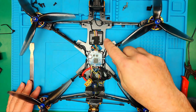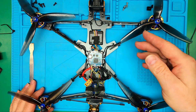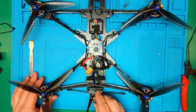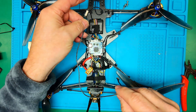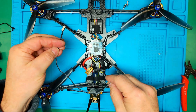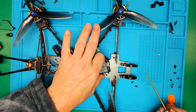What I want to do is move this O4 air unit to the back here. I want to take this capacitor and move it out of the way to provide room. The reason I want to move it to the back is to eliminate the long wires connecting to the antennas up here. Instead, what I got from Amazon is a 300mm camera extension, and that will allow me to run the cable up here to the camera and then have plenty of room for the air unit back here. A 200mm probably would have done just fine, but this happens to be a 300mm.